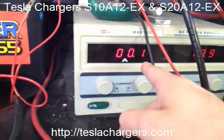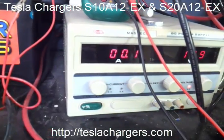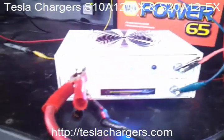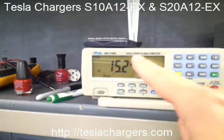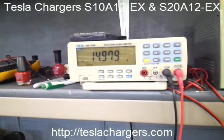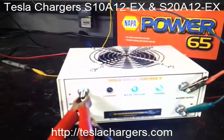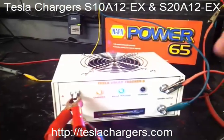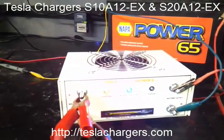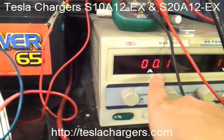There's almost nothing here because it's basically charged up. You just saw that little amperage increase because it gave a charging pulse to it. As it's charging right now, you can see that the voltage is coming up to the 15.3 volt level, and once it hits that level, it's going to say it's charged, so it unlatches the SCRs. Then for about six seconds it'll let the voltage kind of settle back down, and then it'll hit it again — right now it's already charged.